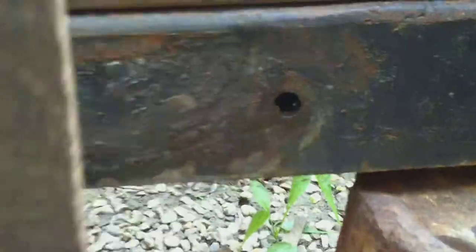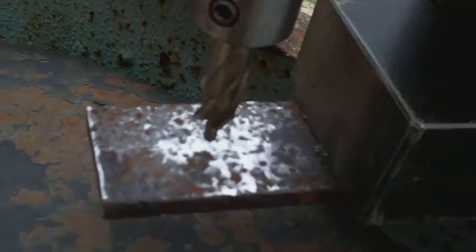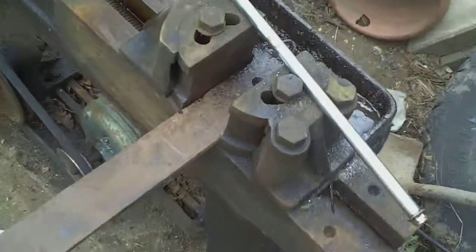I've got the mag drill there. I'm now going to measure that up and drill this stay here — drill a hole through that — and then cut it to length. I left the steel long because then the mag drill can sit on here conveniently. So this is the first stay to hold the sub-base on. I drilled that first stay and now I'm going to cut it to length. I've got this old Norden donkey saw, so we'll get her lined up and marked off.